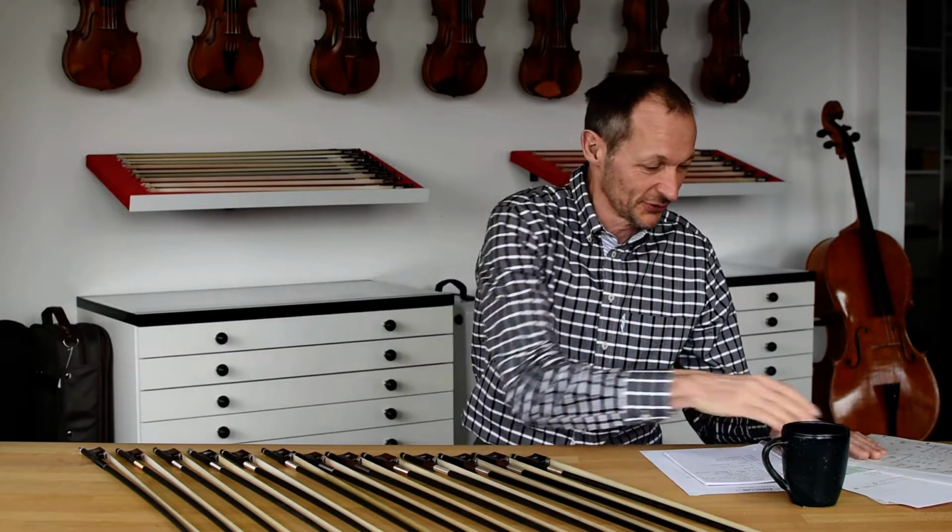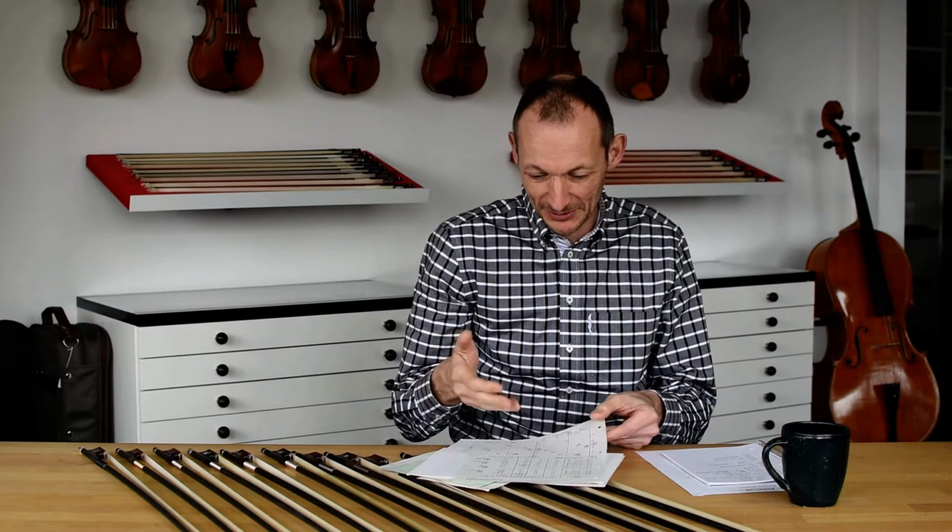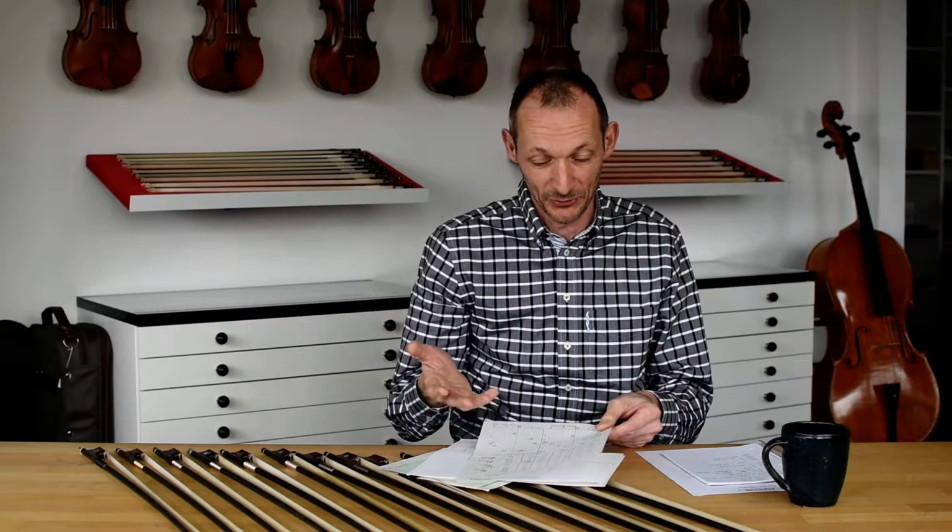Somewhere it can be found. I did quite a bit of research, and I looked through some of my old papers, and I found some very fundamental measurements that I made and analysis of the forces of existing bows, what's happening on the strings, masses, inertia, all this kind of stuff. And then I started to come up with an idea to create a stronger bow, a much stiffer, more resilient bow, with improved elasticity, a somewhat more shallow curve, and a hollow build, quite different from all the bows that had existed up to then.